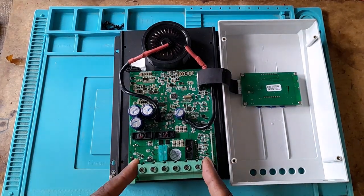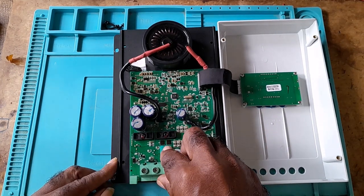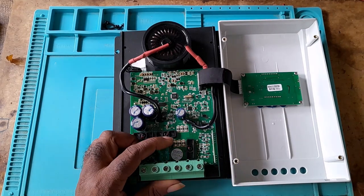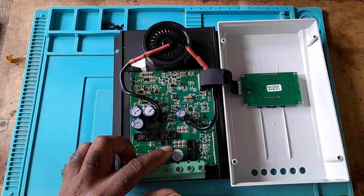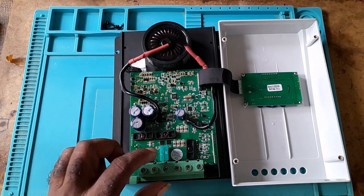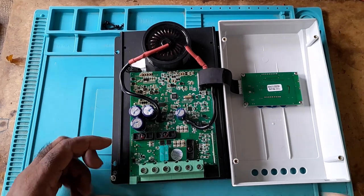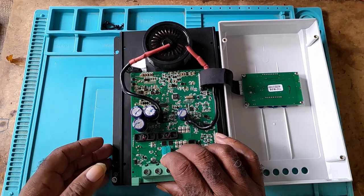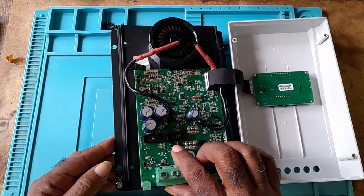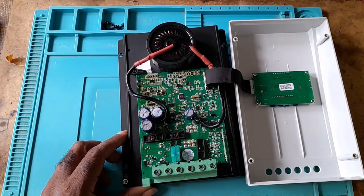This is your connection point. Those are the fuses — 30 amp fuses. This is a 30 amp charge controller. When connecting, if you blow your fuse, you would have to unsolder the fuse and put a spade connector in there so you can plug your fuse in.